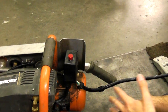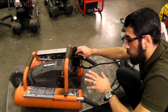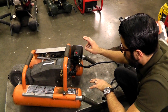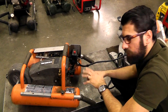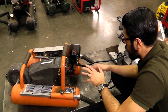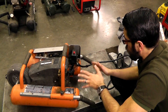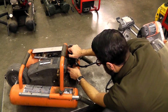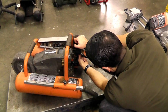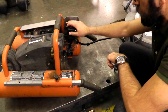This is a typical single-stage compressor, so it's rated for about 90–95 PSI cut-on pressure and about 125 PSI cut-off pressure. If you have a problem with the compressor not pumping up, not shutting off at the right pressure, or not turning on at the right pressure, you'll want to replace this. They're not typically adjustable — it's not really recommended since it's electrical — so it's best to replace it when you have a cut-on or cut-off pressure problem. The unloader line routes from the check valve to the bottom of this switch, and if this leaks, you typically have to replace the whole switch.